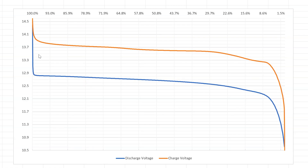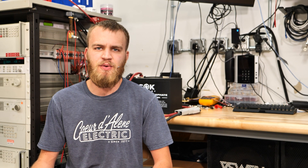Now if you're discharging your battery and you've been going for a bit so it's definitely on the discharge curve, yes, you can plug in various different voltages to estimate where you are. But look at all these waves on the charging curve — that same voltage during charging is not going to be a very good way to determine state of charge. So voltage is off the table.